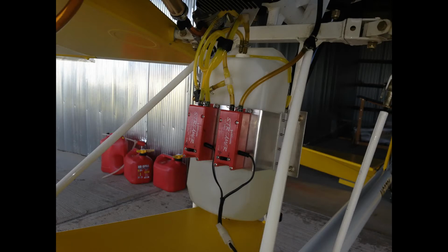The pump on the right is the one that pumps the fluid up to the muffler, and if you look closely, you'll notice that there's a T-fitting on the inlet line, which is the left-hand line going into that pump. What that is on the end of the T is a Sullivan remote needle valve, and that is used as basically a system to introduce a little bit of air into the suction line.